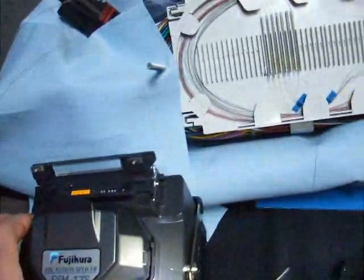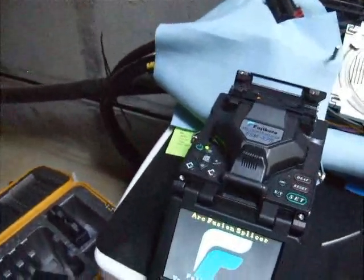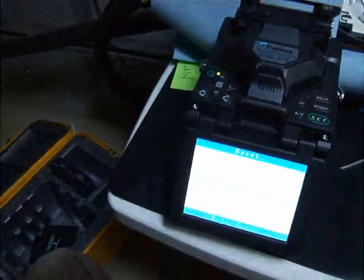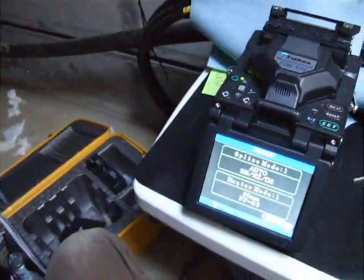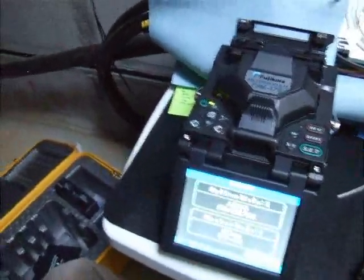As you can see, the two fibers are there in position. Everything is set to go — you can see the cameras are down there and those are lights. Here we go. When I close these drawers the thing normally will come up if it's just asleep. It'll take a little while to come on this time because it's powering up for the first time. It's all set up — 60mm splices, that's the heater mode, it's in automatic mode, and all you need to do is press the set button. It's really very simplistic.